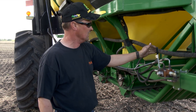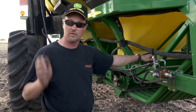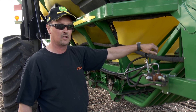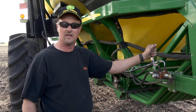The hose is run and here's the actual spool for control. A needle valve was added because with the high output of today's tractors, they needed to slow the oil down or the unit would get out of control. They used a closed center for the porting so that all oil returns back to the tractor and doesn't overload it with the high volume of pump.